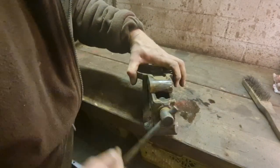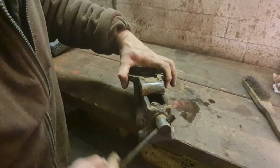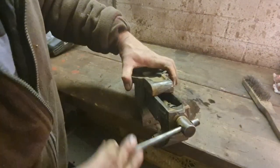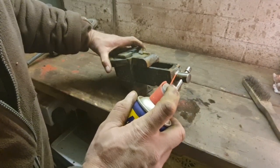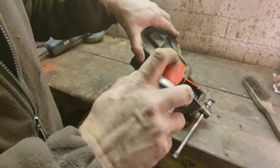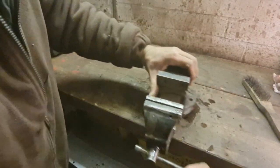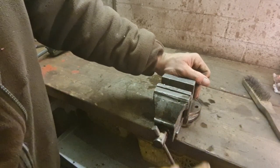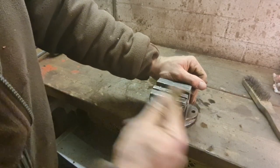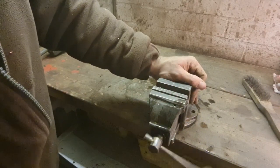Tell you where we haven't oiled. We haven't oiled up this end, have we? Let's unscrew him. Well, that might just be a bit dry in that bearing causing our squeak. So we'll give it a bit of WD in there and all. And in this side. And let's see if I sorted that squeak. It has. So that squeak was all in this end. Oh crikey, that's free as a button now, look. Look at that, free as a button.